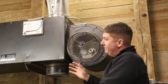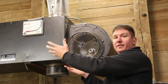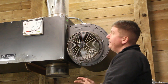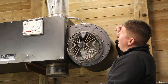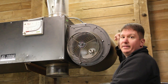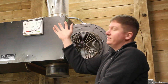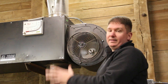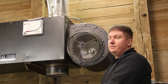This unit can be switched around so you can have the fan on either side — you remove the heat exchanger from the box and switch everything around. This is a fossil fuel burning unit so you have to have triple wall pipe. On this one there's eight-inch triple wall pipe going up, and there's also a vent on the inside with a manometer that keeps everything in check so we know we're not breathing bad fumes in here.